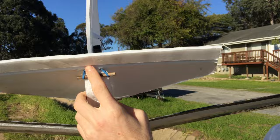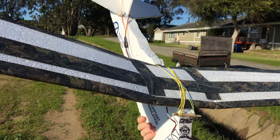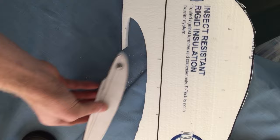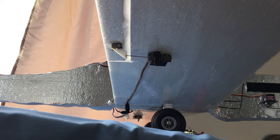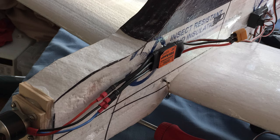It can be a good idea to poke skewers through the fuselage and rubber band the tail on, but I just hot glued the tail on this time. A high wing design may be able to just sit flat on top of the fuselage, but a low wing airplane is a little bit more tricky. I put the airfoil templates on either side of the fuselage and cut out a slot to put the wing in. Then I poked some sticks through the fuselage so that the wing can be held on with rubber bands. Ailerons were initially made from strips of foam board but then I decided to cut out the ailerons from the wing itself and hinge them with tape.